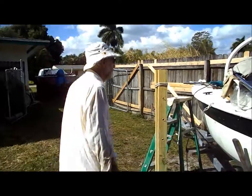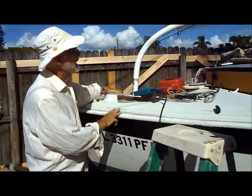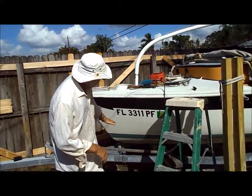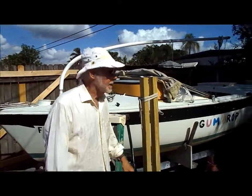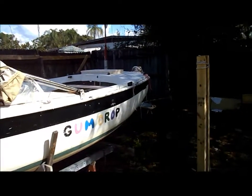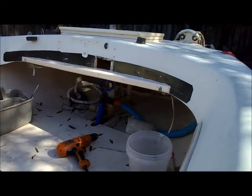Brenda's been on the boat. A couple of points of interest: this was rigged as a cat. It had a cat rig with a mast here and a Gary Hoyt boom. So we're going to have to cut that through in the bottom of the boat. It also had an inboard rudder with a tube that's going to be cut off. Once all the hardware's off and the tubes are cut off, then we can go ahead and cut the deck off.